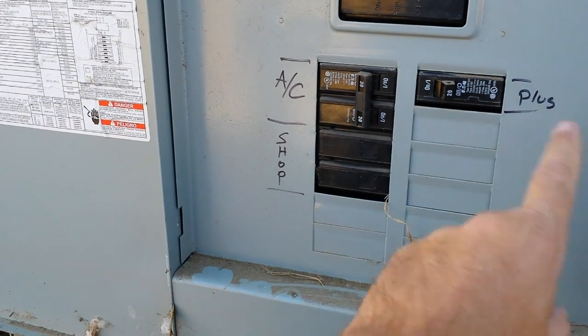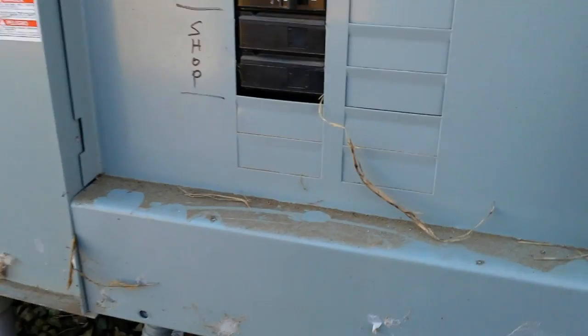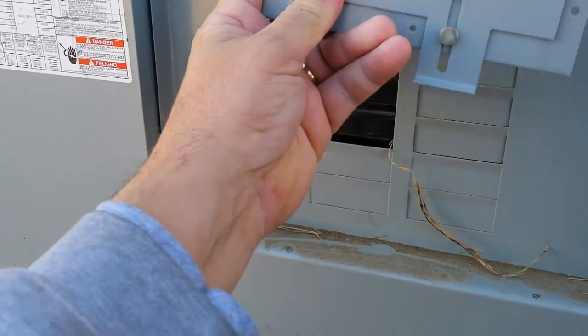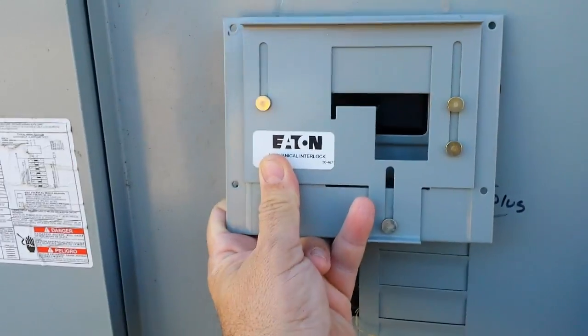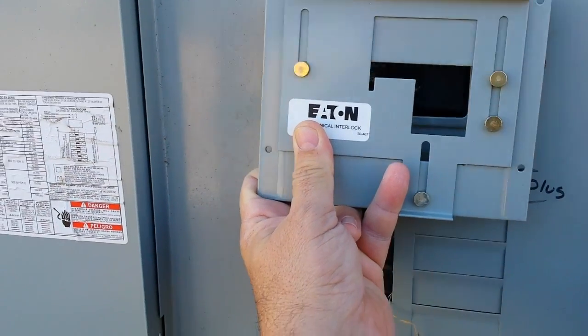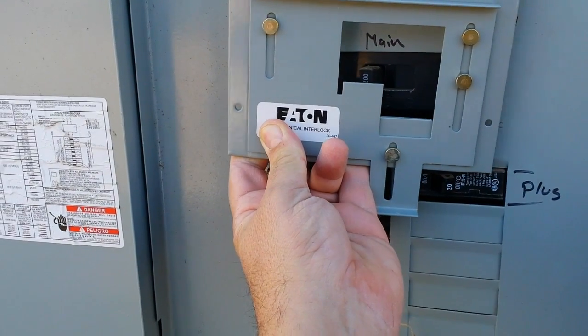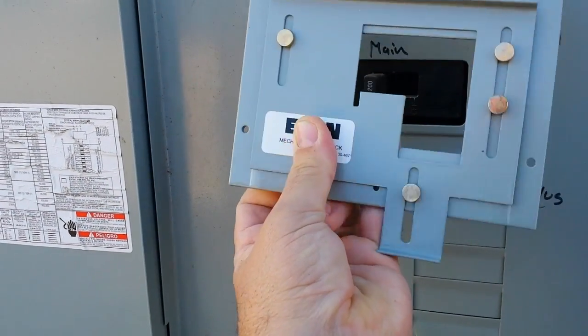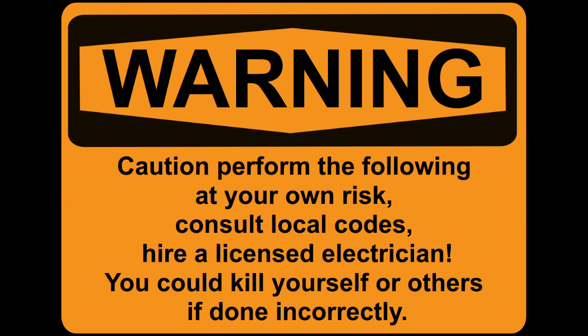After that it will power that. You put this on here to lock out. It's designed so that you can't flip this up with the main breaker on, and without that flipped up, you can't flip on the breaker in that spot. So you can basically have one or the other on only at once. That's designed so that you don't feed back into the system when you get your generator on.